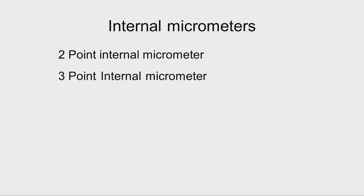Now, let us move to the internal micrometers. There are different kinds of internal micrometers, like 2-point internal micrometer and 3-point internal micrometer. The problem with 2-point internal micrometer is, say we have a hole of this shape. So, if we use a 2-point internal micrometer, this is the micrometer. Contact will be at only 2 points,